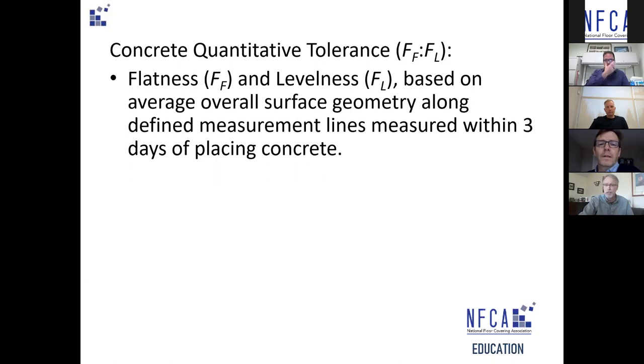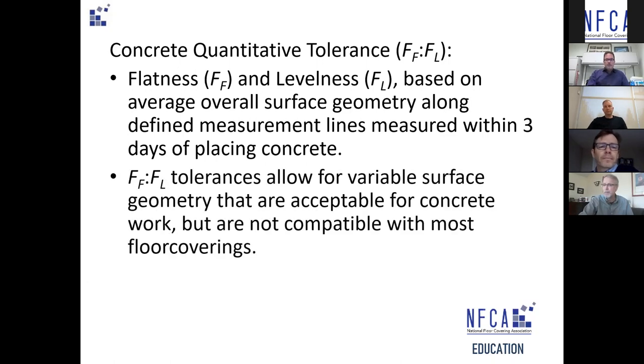The instrumentation is also an issue. Concrete used to use a straight edge that was leveled and placed almost anywhere on the floor — which gave an advantage to people placing the concrete. It also pointed out that you could successfully pass a straight edge test but not meet the requirements for floor coverings.